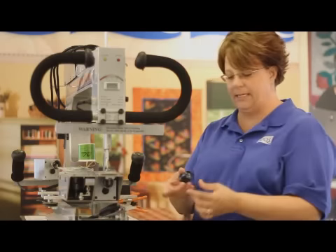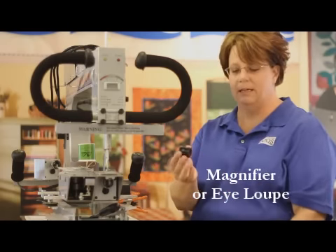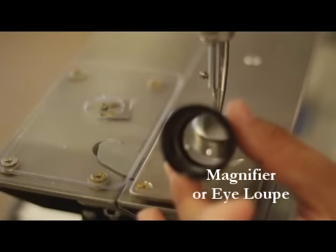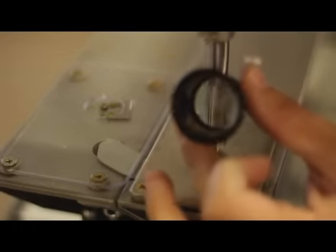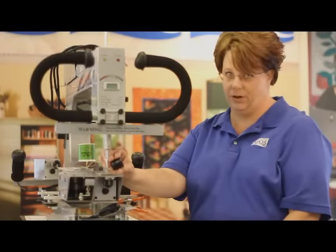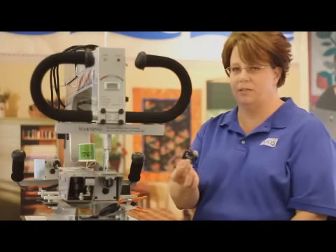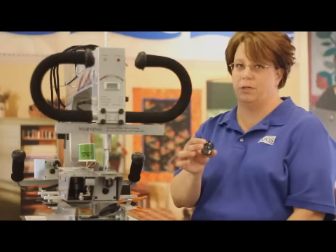The final thing we need is some sort of magnifier. We have this little jeweler's loupe here — five times magnified. It's super lightweight and very handy to get right down and look at your needle bar. When you're doing the timing you have to be right there and very close to see exactly how close your needle bar and your hook are to each other — it's that important. There are several variations of these magnifiers; look at your local hardware store to see what you can find.